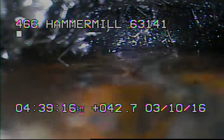The area in the basement where the stacks are is completely finished off, and trying to run a cable machine may cause some damage. The homeowners are wishing to have this area dug up and replaced because of the way the plumbing's put together, with a capped off Y instead of a couple of sweeps. That way in the future, the line will be easier to maintain.